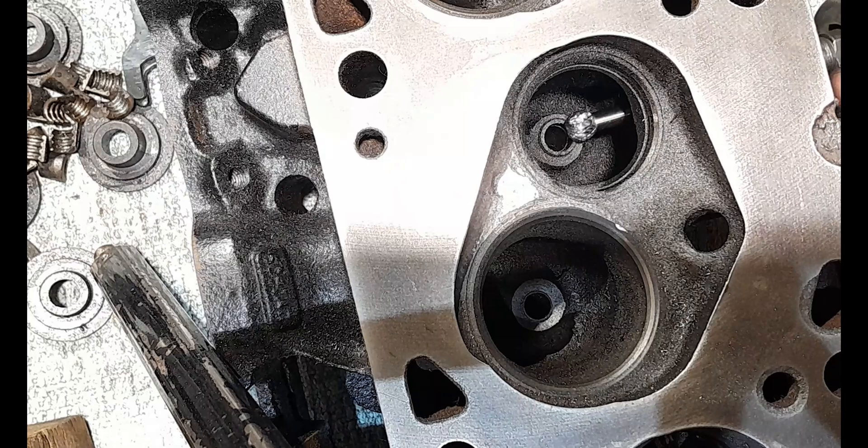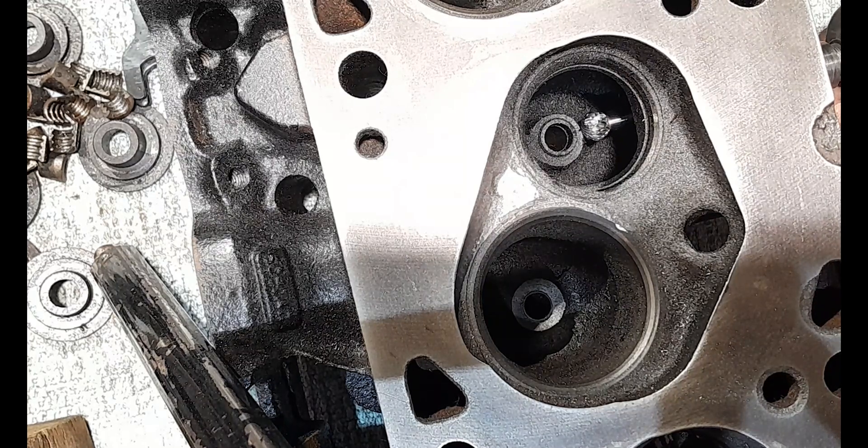I make sure my cylinder head is positioned so I can rest my hands on the bench holding the front of the die grinder, with my other hand on the very back, so I have really good control. The ball at a certain angle is like hitting the kickback zone on a chainsaw - it'll want to grab. You just got to watch that and be careful, because you can snap these burrs if you jam them, especially in these electric die grinders running at 33,000 RPM.